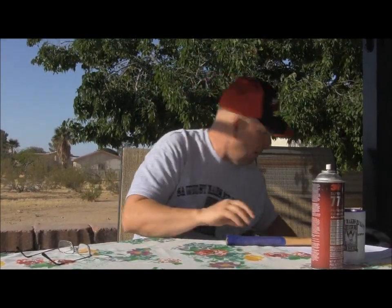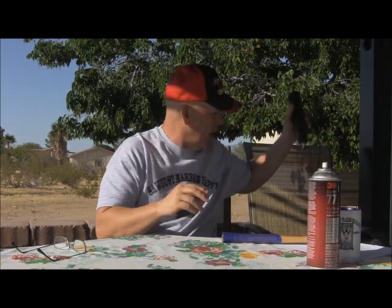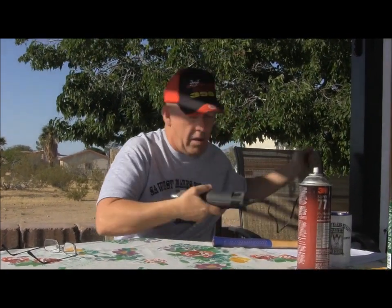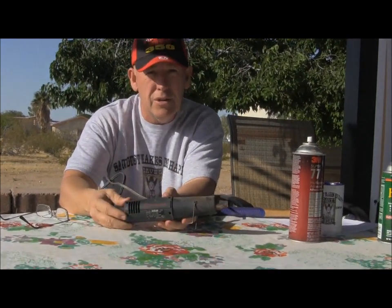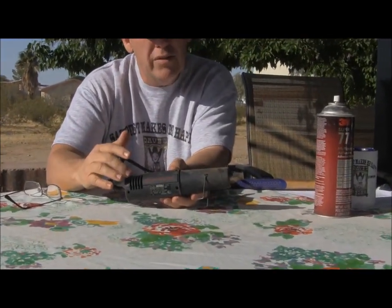So that's number one. I'm not sure if that's the adhesive that you're using. Number two, once you're pulling that paper off the board, you want to try and get as much of that paper off the board before you go into your sanding operation to sand the paper off. But I used to sand it all off too. But this is what I use now, and it works out really well. It's just a little heat gun. And we've had this for, obviously, years and years and years. But get yourself one of these, Jim.